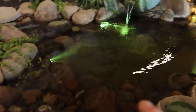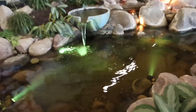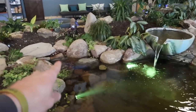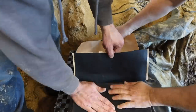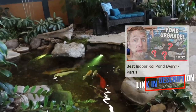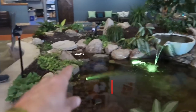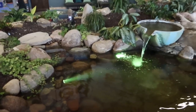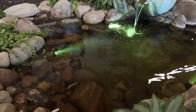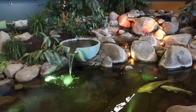What we did was shut the pond down and make sure the water level stabilized. We shut everything off and realized the pond itself held water, which was a huge sigh of relief — we had a 15 to 17 foot seam and cover tape patching the old skimmer hole. Once we confirmed the pond held water, we knew it had to be in the plumbing, the stream and waterfall, or something to do with the bowl.